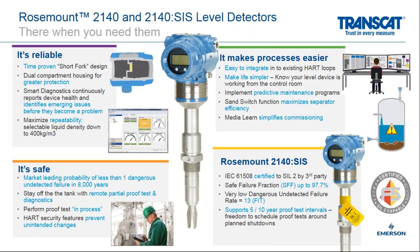Now, this device operates in a pretty narrow band when it's dry. It's nominally 1400 hertz. And generally, equipment doesn't operate in that exact frequency band. So that's number one. And number two, we have all this advanced diagnostics where we're actually looking at not only the frequency, but the amplitude of the signal coming back. So anything out of the ordinary will be caught by this device. A vibrating piece of equipment that's vibrating this transmitter is going to give an unknown signal back to the electronics at the top, and we're going to be able to detect that if it gets out of hand. Generally speaking, we don't have a problem with this on any of our analog products or this new digital product as well. There's a very, very low incident rate of any vibration interacting with the fork switch itself.